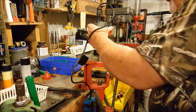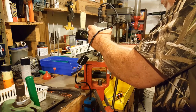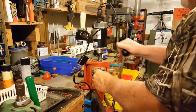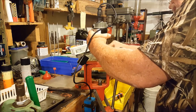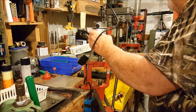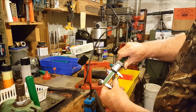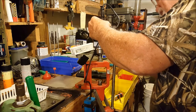2.527 — that's a little bit low. Wouldn't hurt anything, but we're gonna get it right. Still haven't got it through yet. 2.531 — that's going to be close enough. 2.530 to 2.540, and we're at 2.531, so that's okay. Now I'm going to tighten that and make sure it's nice and tight.